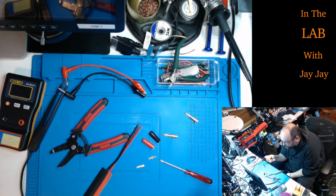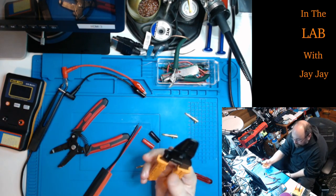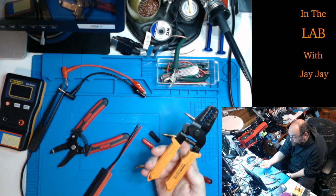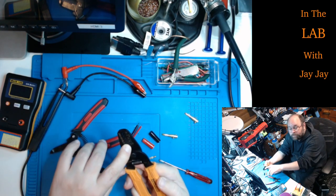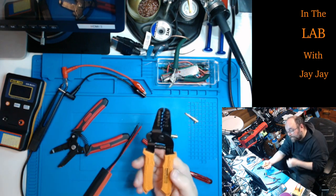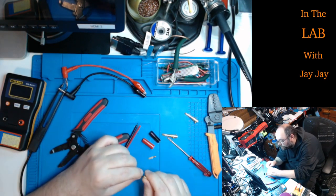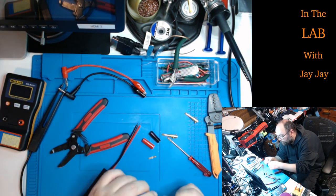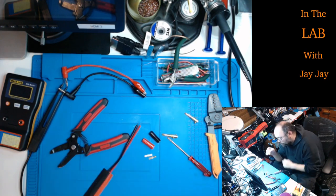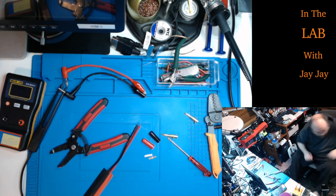Yeah, all right. I'll tell you what, I'm going to finish this cable another day. I'm going to get myself a new one of these engineer crimp tools. This one only goes up to 1.9 millimeters. The one I'm planning to get will do up to 2.5 mil, which ought to be good enough for this. These are 2.8 mil on this end, but I think that the bigger engineer crimping tool will work for our purposes.